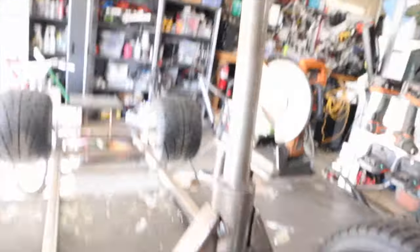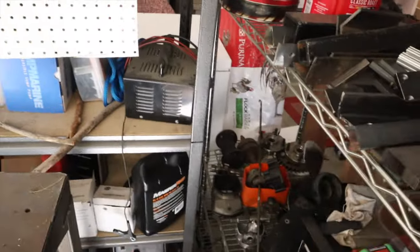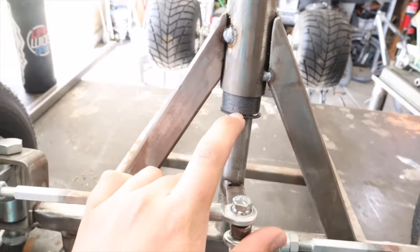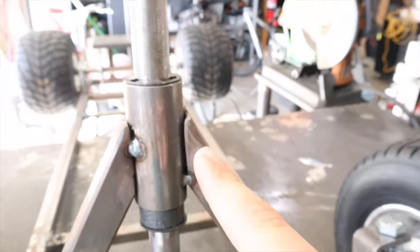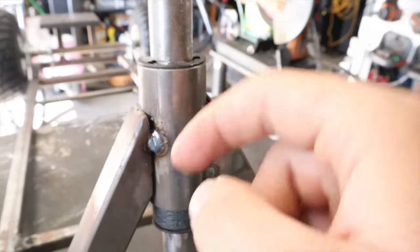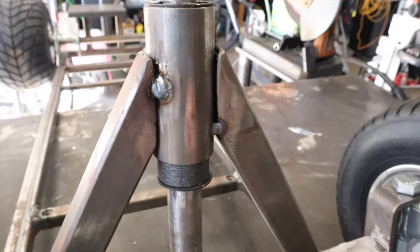On my dew cooler is this material with this pipe going into it — it's metal on metal, which is not great for wear. But there is this miracle material called Nylatron. This is some kind of plastic — you could put a grinder on it and it doesn't wear. It melts, but it doesn't wear, so this will last forever on here. What I did was I made a one-and-a-quarter steel sleeve. Then I made the OD of the Nylatron one-and-a-quarter so that it can be hammered down into it. I actually made it too long, so I'll have to cut that.